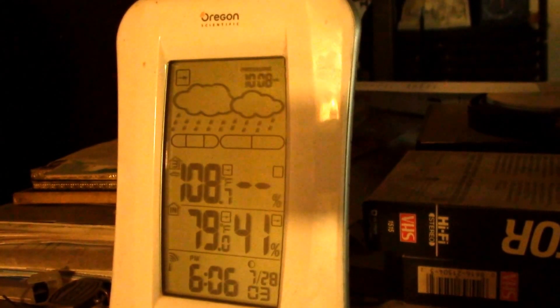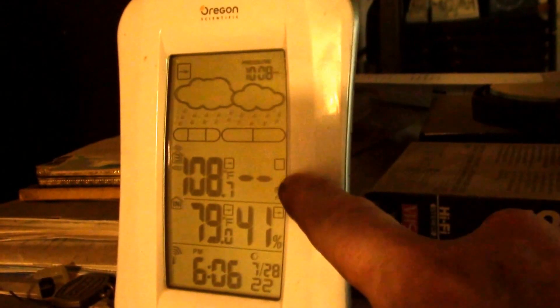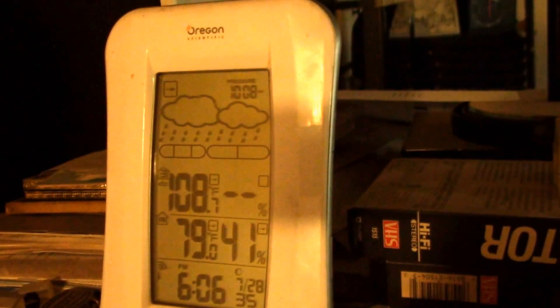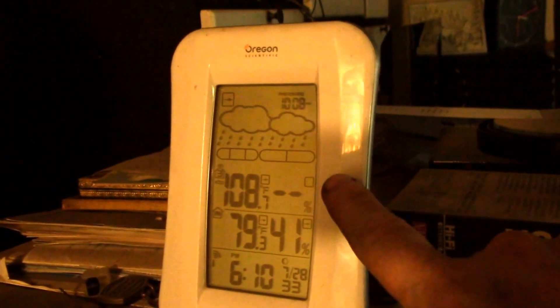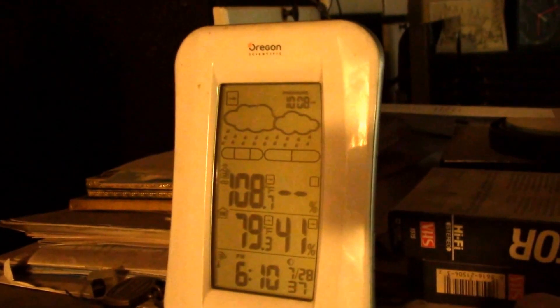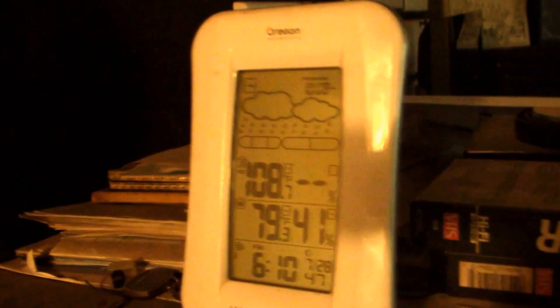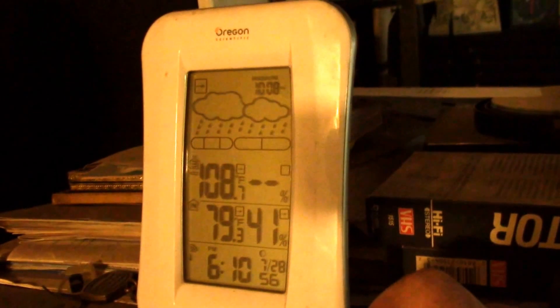This morning it was about 73°F inside the attic. I ran the whole-house fan and brought the inside house temperature down to 70°F, and it only went up nine degrees over the day — a lot of that is due to the attic insulation and ventilation. If you keep the attic 20 degrees cooler, you keep the inside of the house probably five or six degrees cooler. Previously it would have been in the mid-80s. The attic ventilation fans alone dropped the attic from about 135°F to 120°F, and the radiant foil dropped it another 10 degrees. The combination of both is key — the radiant foil reduces heat gain and the fans blow out the heated air and pull in cooler outside air.